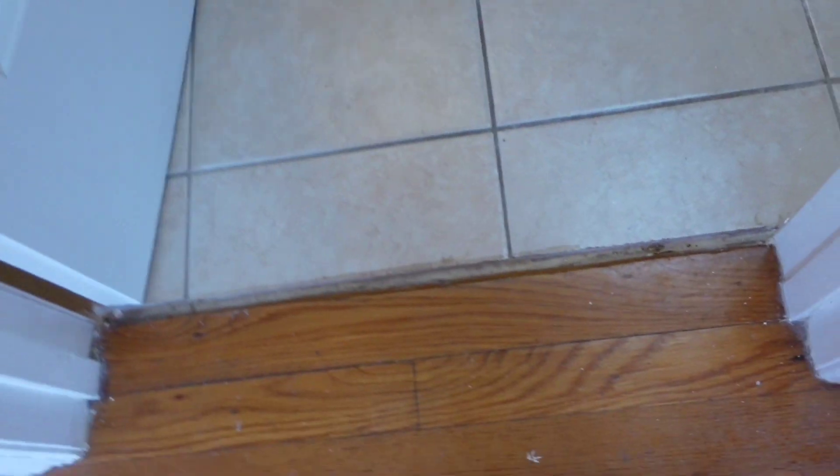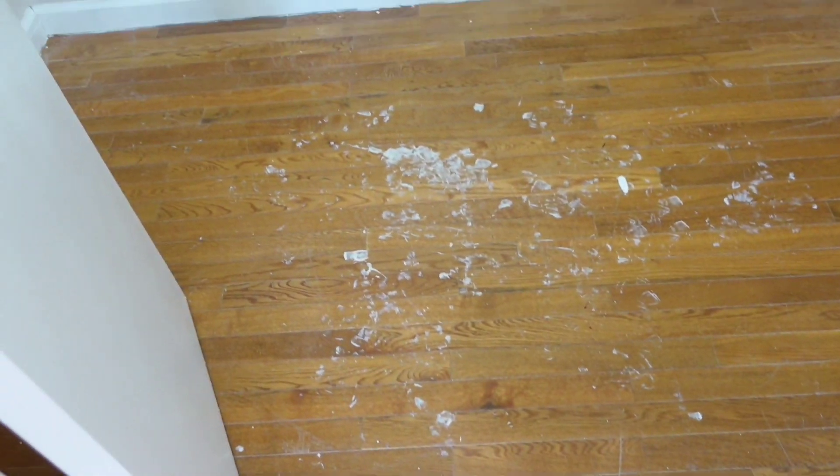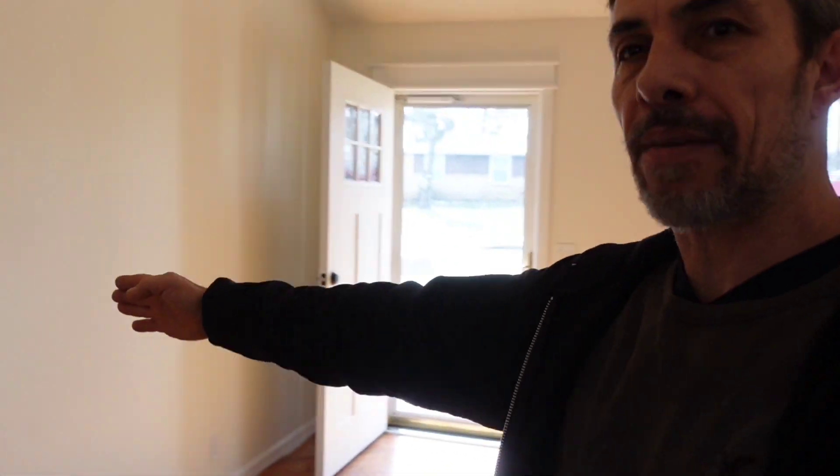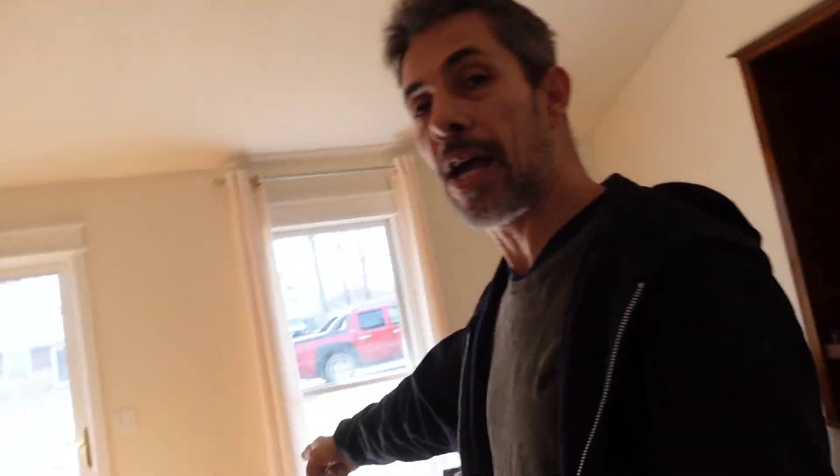Of course over here we're going to have a transition to deal with, so you guys will get to see that. And there's just straight hardwood into the closet right there — nothing different or fancy. I'm going to go get my laser level out, set it up, and make a control line. We have the living room over here and the bedroom over there, so if we're going to start against this wall, we're going to have to figure out how to get that thing straight when coming around and going into two different rooms. I like to use a laser level for that — I'll show you how coming up next.